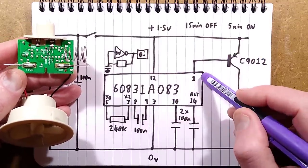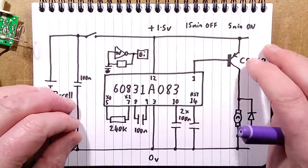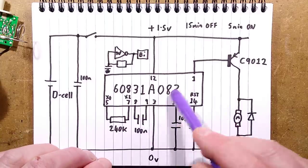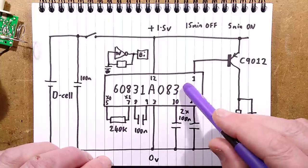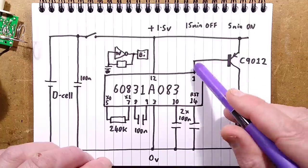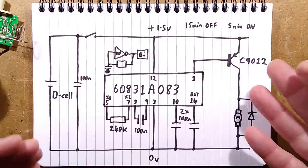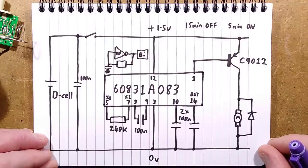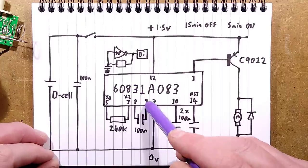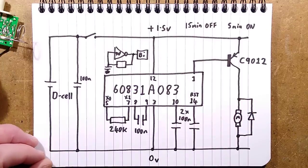The timing is one part on, three parts off for the fan. I didn't leave it running for ages because it takes quite a long time just sitting waiting for the fan to start. But that's more or less it — the binary counter and gating logic detects when it's time for the fan to run, then pulls the input to the PNP transistor low, which turns on and drives the fan. It has a protection diode across it — all very logical and simple. This circuitry reminds me of the 4060, but I don't think it is related to the 4060 since it's got purely binary outputs.